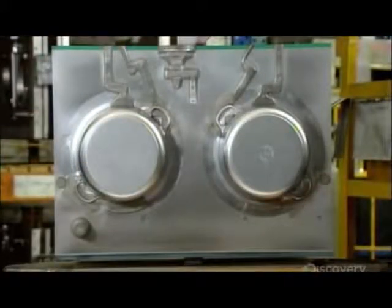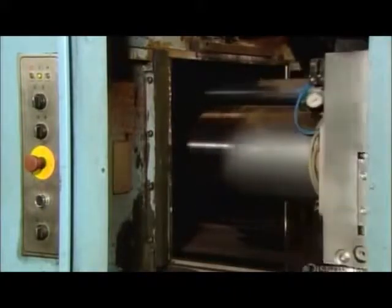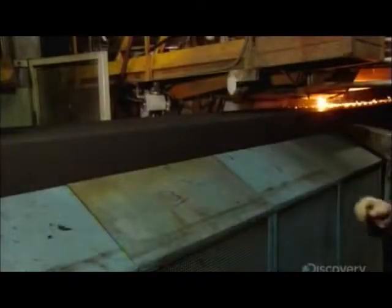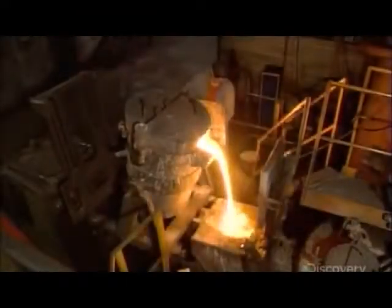Meanwhile, workers mount a two-part mold template onto a machine which produces the sand molds with which they'll cast the cookware. The machine injects the sand mix into the templates. The mix contains clay, water, and proprietary ingredients which make the sand compact well. Compaction is critical because just one single grain of sand displacing from the mold would produce a flaw on the cookware.